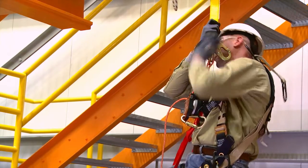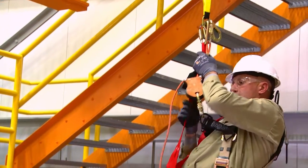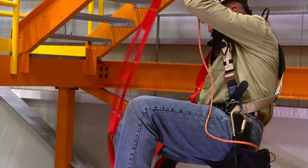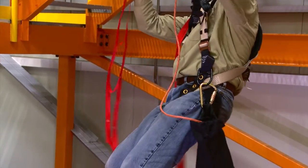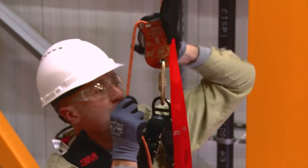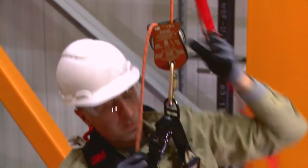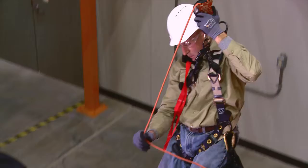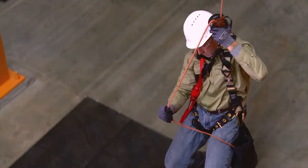Reach up and disconnect the lanyard from your harness. Slowly lower yourself onto the 3M DEUS 3000 series, carefully managing the transition from unloaded to loaded rope so as not to impact load the rope or the descent device. Descend under manual or automatic control using the 3M DEUS 3000 series controlled descent device to control your descent speed.